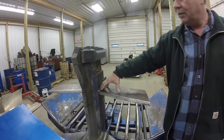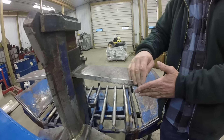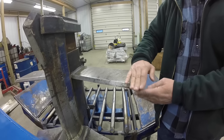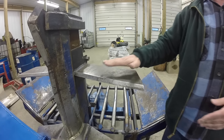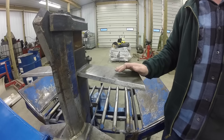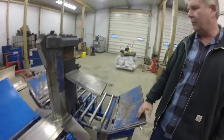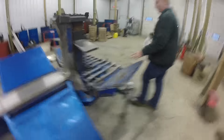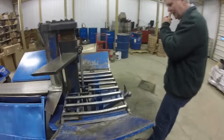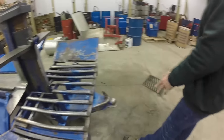We also put the splitting knives on an angle because the wood enters in here first, so this point starts to split and then does the rest. If it was blunt, it takes a lot of power and busts up too much. When the wood gets split, it falls down here — we built a grate and just the garbage falls through, then it goes onto our conveyor.